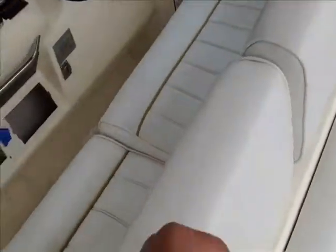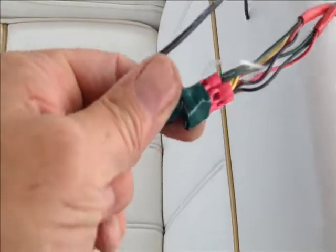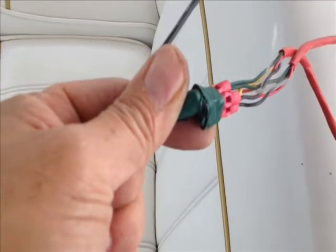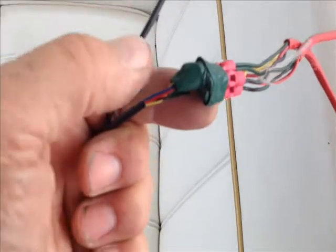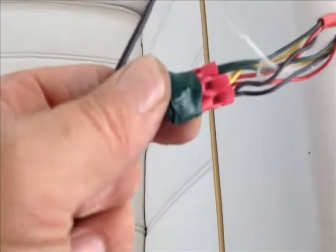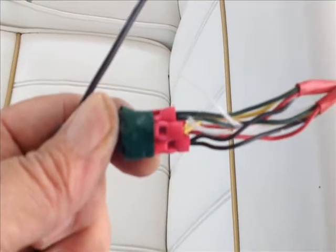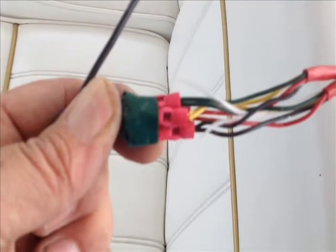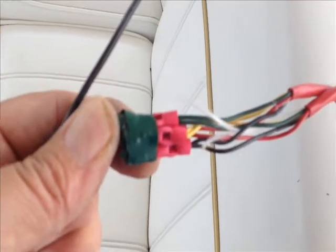George Shively back with you here. I wanted to show you something I pulled out of the arch — here's an example of what you don't want to do on a boat. Electrical tape does a great job for pulling wires and miscellaneous odds and ends, but when it comes to fixing wires to something, you really don't want to do that — that's what heat shrink tubing is made for. Also notice the type of butt connectors they used; on the yellow wire you can actually see the connection is starting to fail already. Those are not watertight connections — moisture will get in there, it will corrode, and it's not good.